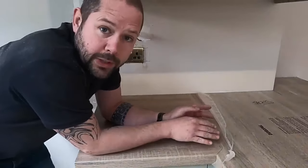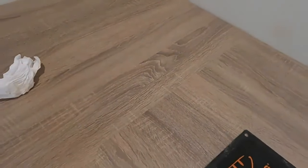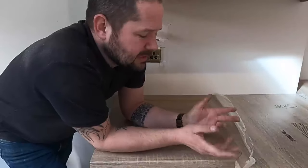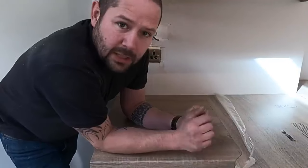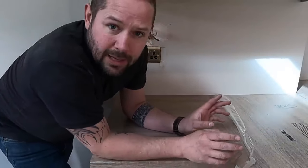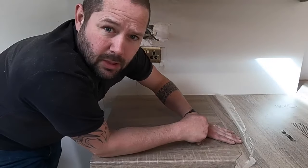It's up to you what you put in your joints. I use silicone - I find it holds perfectly well. Over here you can see a silicone joint with no colour fill, and I've been doing that for about 17 years without one failing. Some guys use colour fill, some use PVA - it's your discretion. Let me know in the comments what you use. Basically what we're going to do now is bolt up below. I'm not going to show all the bolting here as there's a dedicated video, but I will show you how to get these nice and flush while you do the bolts up.